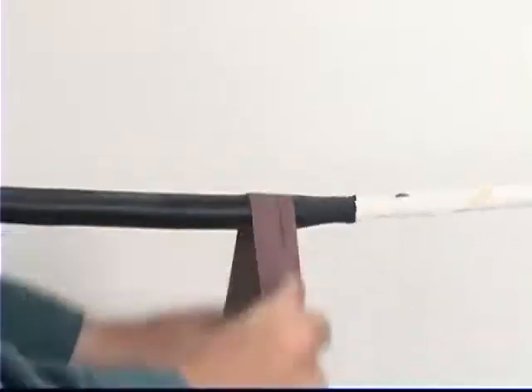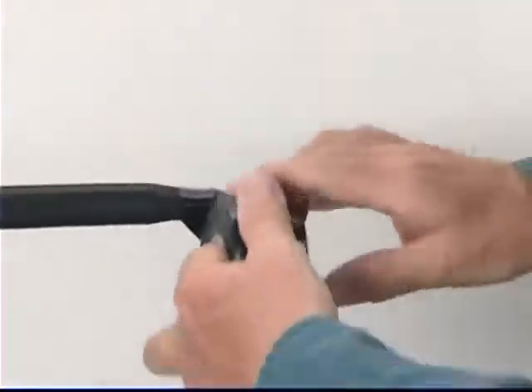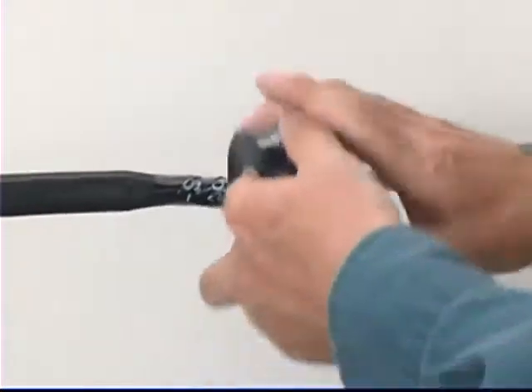Scuff and clean three inches of the cable jacket beyond each split end. Bind the cable assembly with 3M Brand Temflex Vinyl Electrical Tape 1700P.